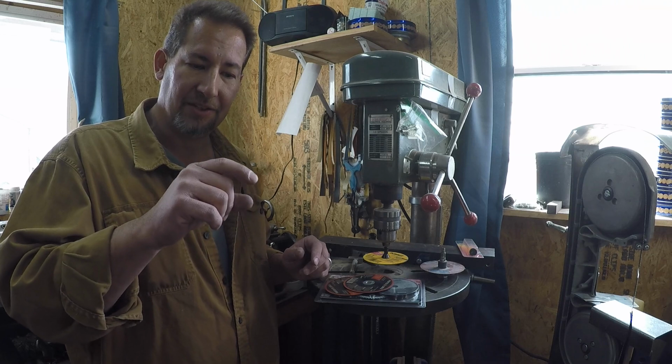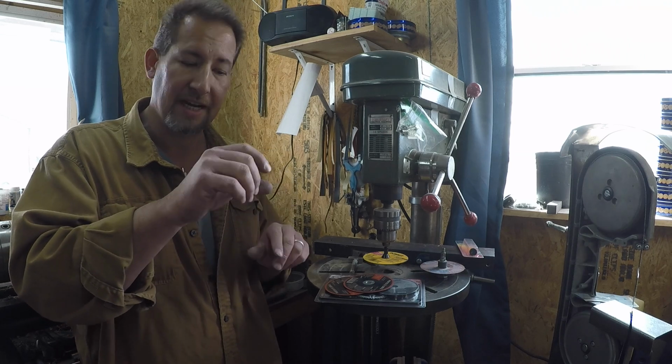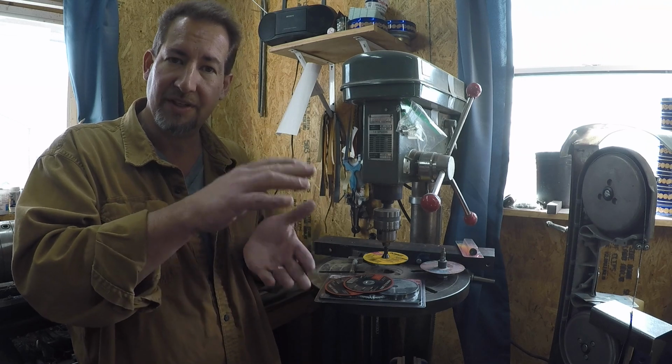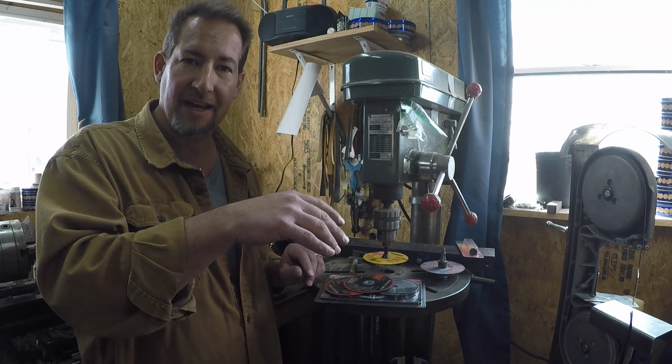So cutting in a nail nick before heat treat, now you're stuck with that nail nick where it's at. So if you screw up the position of your back spring and the tang, and you end up having to move it too many times, and then you go to grind the back line of your pocket knife and you grind into that nail nick, well, now you've got to throw that blade away and make a new blade, just over the nail nick.